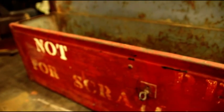I've got some pieces cut out here just sitting on the bench. I made up all my blanks, did all my calculations and stuff, cut out all the blanks. And we're making this out of 14 gauge cold rolled steel. And you could see how the box, it's got a bend there, and then it comes around, and then it goes all the way down and bends, comes around the back again. So that's one big piece, and we'll put those bends in there, and we'll use the pull max and the flanger and things like that. And I'll just show you how we put this box together.